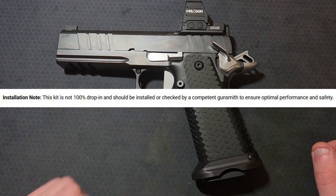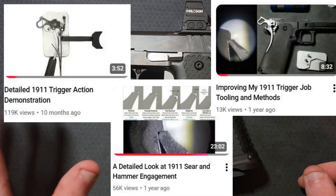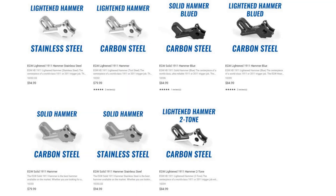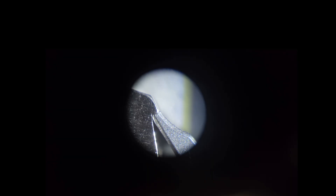EGW states as much in the description of their ignition kits. There will be links in the description to relevant videos of mine if you have questions about what I present here. I will also list the pages from the Kuhnhausen manual that I present diagrams from. I buy a lot of parts from EGW and have generally found them to be good quality at a reasonable price. Their hammers are expensive — $75 to $95. The stainless steel one I bought was $95 and had quite poor machining quality: the countersinks around the pinholes were rough, both pinholes were a bit too tight, there were rough edges, tiny burrs, a gouge, and uneven rough chamfers all around. I should have sent this back — this is unacceptable quality, especially for the price. I still buy EGW parts, but will never buy another one of their hammers.